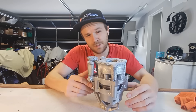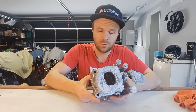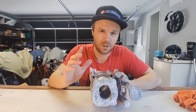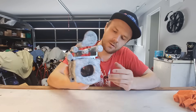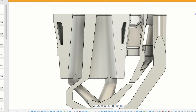Well there we have it, that is our first attempt at casting a barrel. I say attempt because as you can see we have plenty of odd imperfections. The main two causes: as I was worried about, the water jacket core moved - it must have moved during the pour because after the burnout it was still in position with no cracks. The other issue is there's heaps of little areas around it which aren't filled up. My theory is the thick section next to the thin section is stealing all the aluminium, leaving the thin one not filling up properly.